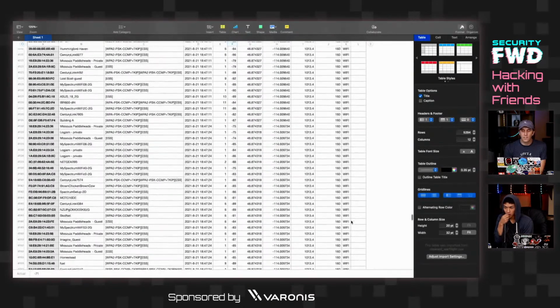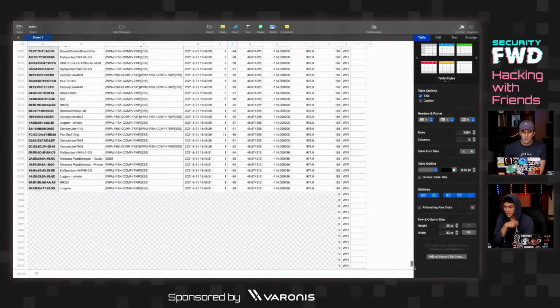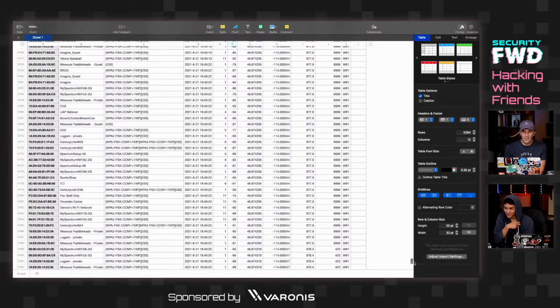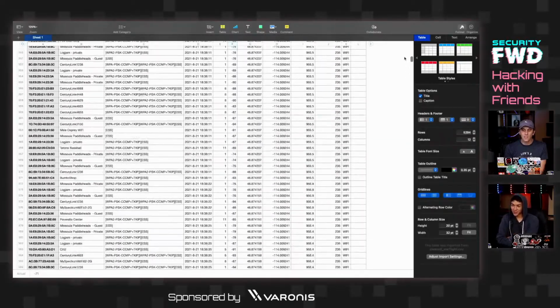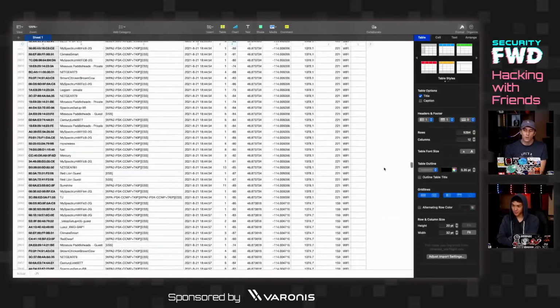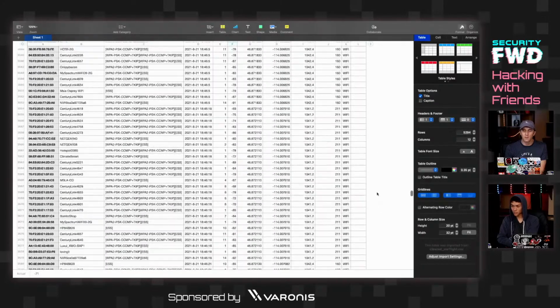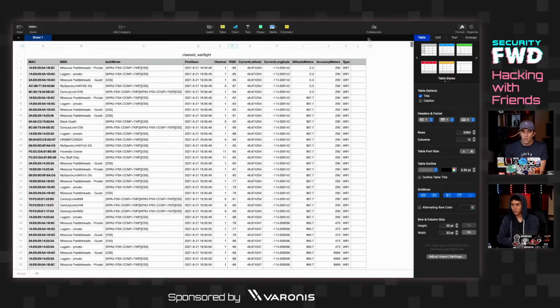So this basically lets you know how far off the GPS could be, or what the margin for error is. Well, 160 is a heck of a lot. It is. But it's better than 9999. That's when it started up. And I have to fix that. And then 420. Nice. Yeah. So as you can see, once the GPS gets set up, it does its thing. But yeah, that is kind of a wide margin for error. So maybe we should look into that. But then again, we were also doing this flight pretty quickly before it had much of a chance to set up. So we can see the minimum rather was in the 150 range.